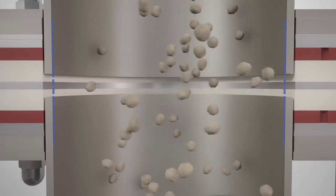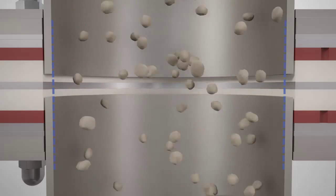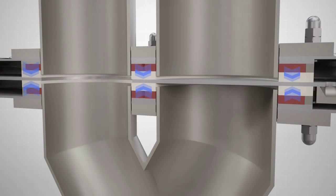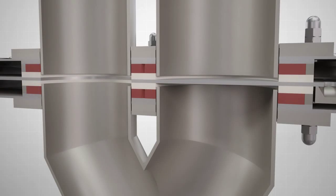The Wide Line Diverter is designed so the seal plates are shielded from material flow, providing long, reliable service. These wear-compensating hard polymer seals are continuously forced together by the compressed rubber backing, maintaining a positive seal even as the polymer begins to wear.